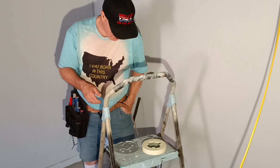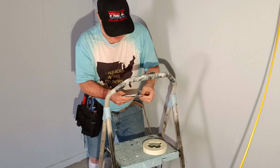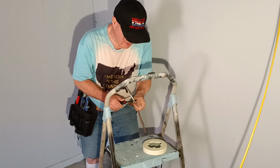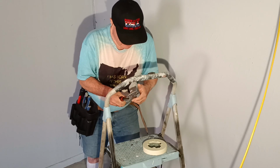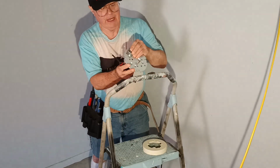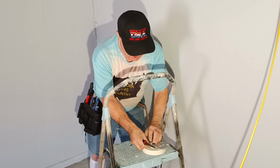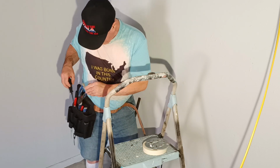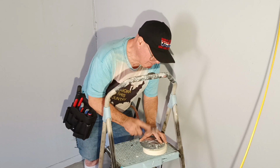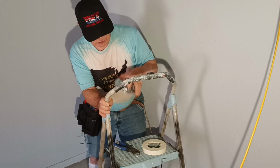Okay, there's our screws. Okay, so we'll open up a hole here at the top here. And we have a Romex connector here that'll go into the back of our box, and see the little tabs here. This will lock in underneath here. We can put it right here. And see how the little tabs lock it in place.